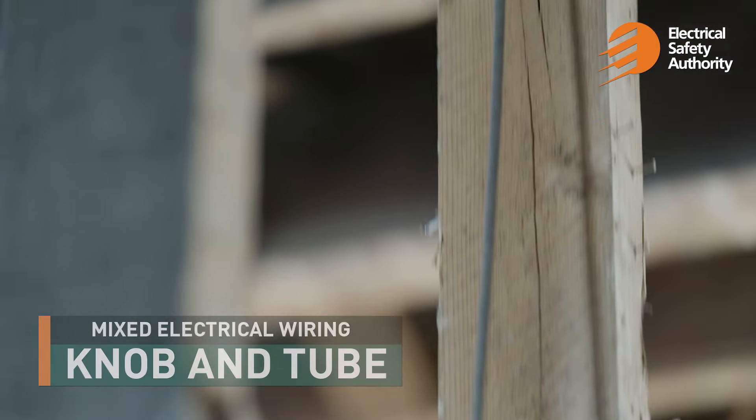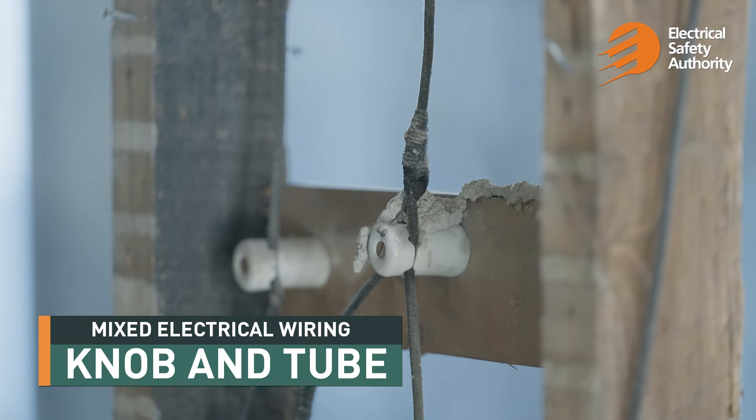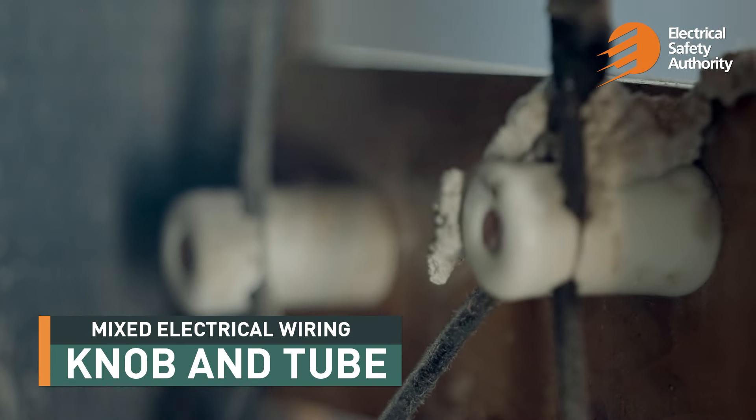What's the issue with mixed wiring? When you have multiple wiring methods like knob and tube, aluminum, and copper, it could create a lot of issues. Knob and tube is typically safe when it's not disturbed and the insulation is fine inside walls, but in an unfinished basement people tend to hang stuff up there, put hangers on it, and eventually the insulation falls off, creating a shock concern — and before you know it, someone's really getting hurt.